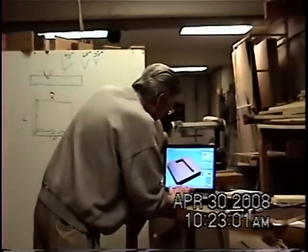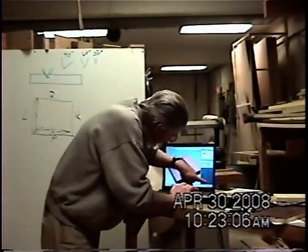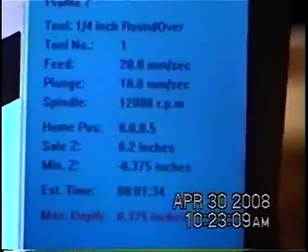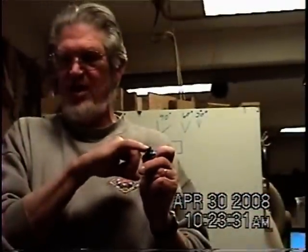When you get done with it, if I tell this to close, it tells me that that cutter is going to be going 0.375, which is 3 eighths of an inch deep. This piece right here sticks down an eighth of an inch from where the cutter starts. So I want to go down a quarter of an inch, but I had to tell the machine to go 3 eighths so I could get past where this was at. Because when I zeroed it out, that's when it was touching the board — that was my zero point. So I had to tell it to go 3 eighths in order to get this to go down a quarter of an inch.